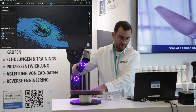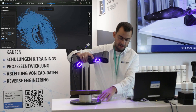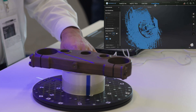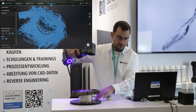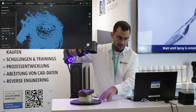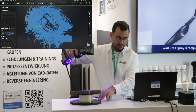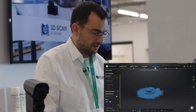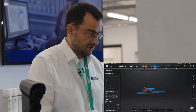Scanning is really fast, and if I want to capture small gaps I can switch to the single line mode, just like before. All the good things already implemented in other FreeScan scanners stay. You can see that the single line penetrates much better into holes compared to the 26-line mode. The toolkit for cutting out your model is the same — nothing new to learn if you're already a user.